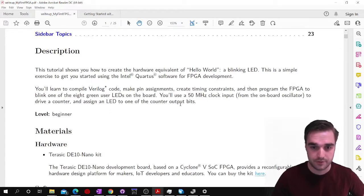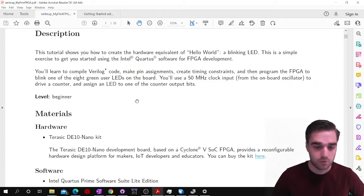So this PDF is actually pretty nice to read. You should read through it if you're interested. Oh, by the way, let me switch back over to the tabletop. I should have mentioned this earlier, but please make sure that you have your SD card removed from that slot right there. The thing that I learned from this tutorial is when you have that SD card in there, it is actually going to erase any design files that you put onto your FPGA. And this has the out of box preloaded image that came with it when I purchased it, already loaded on there. Remove that from the board before you plug it in, connect it and everything. I think it won't matter for adding the USB Blaster drivers, but from this point forward, I would recommend disconnecting power, remove the SD card, put it somewhere safe, put the power back in, and we'll be good to go. All right, anyways.